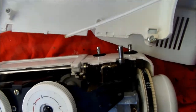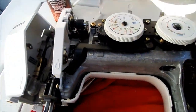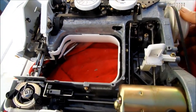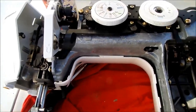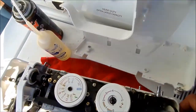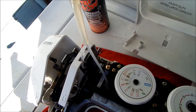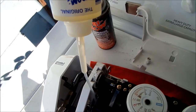There are several parts up here that should be oiled — this main shaft here, and the main moving parts here. You can tell the moving parts by simply moving the mechanism and looking for them. You just want to put a drop of oil on all the moving parts, except for the parts that have felt on them — saturate that felt, but don't overflow it. Make sure all the moving parts have a drop of oil.